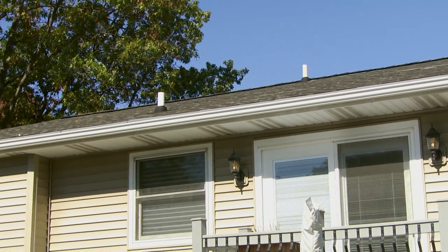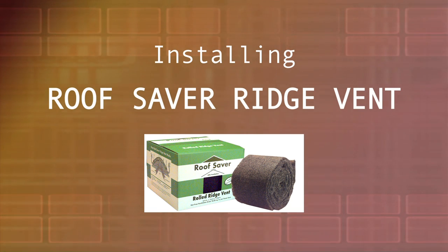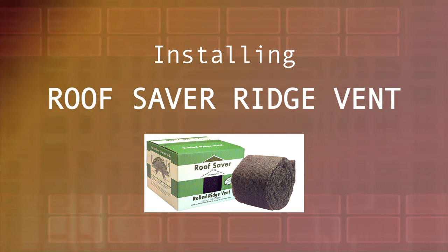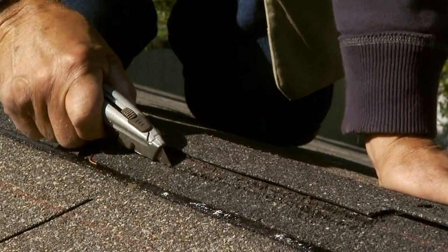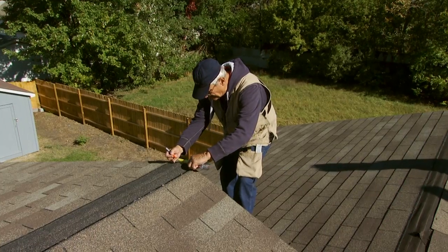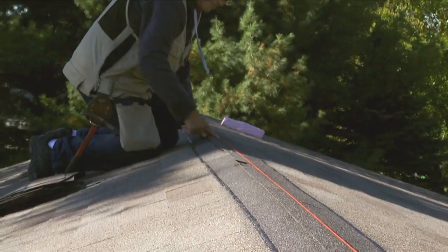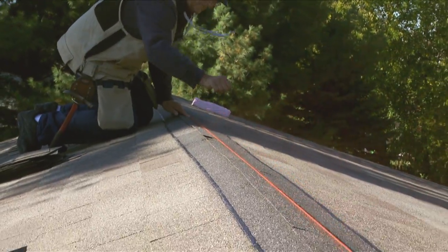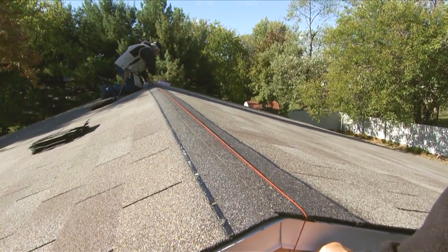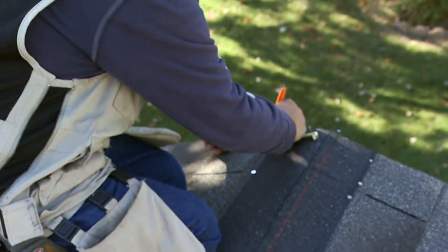Return to this video after you have your ventilation plan. Now that you have a ventilation system plan, we can move ahead with the steps for installing Roof Saver ridge vent. For re-roofing jobs, remove the cap shingles and roofing felt from the roof ridge. Prepare for the slot by measuring one inch on each side of the ridge and snapping a chalk line along the length of the ridge. For roofs with a ridge board, measure one and three-quarters inches on each side of the ridge and snap the chalk line.